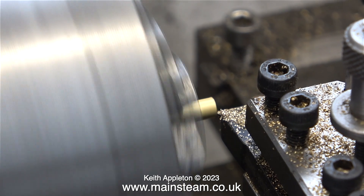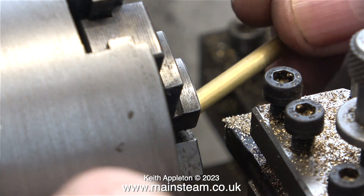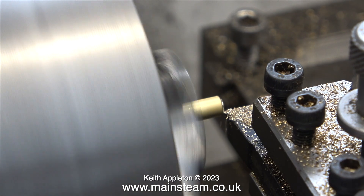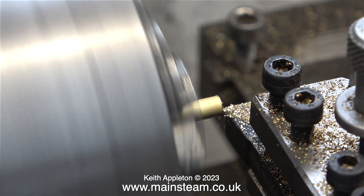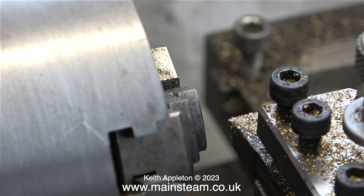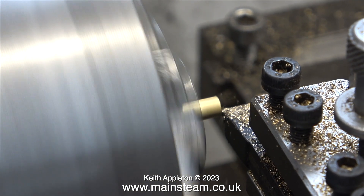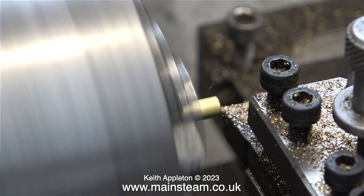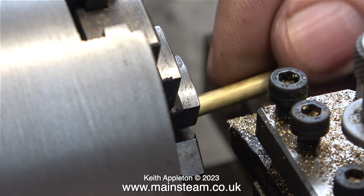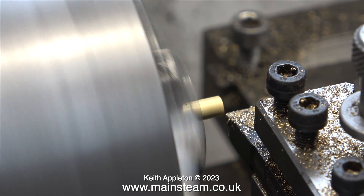One at a time I fitted the water gauge protector bars into the chuck of my Myford lathe, because at the moment it's the only lathe in the workshop that's actually fairly clean. What I'm doing is facing across the front of each of the bars, just at one end to start with. Because most of these bars are cut to nearly the length I need, I don't need to remove much metal. The logic is I machine one end of each bar and then measure one and seven eighths of an inch on every bar, so all the protector bars will be the same length.